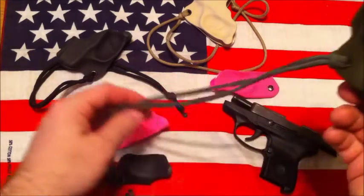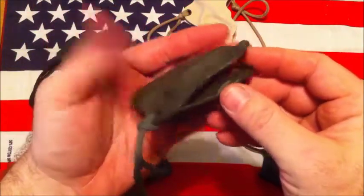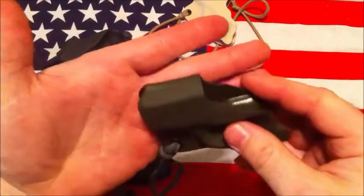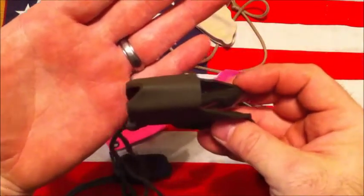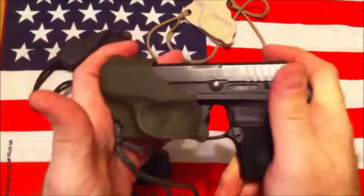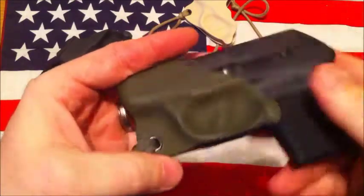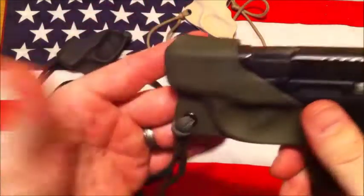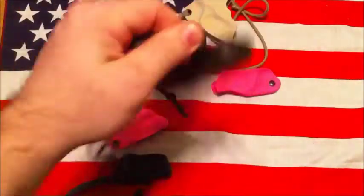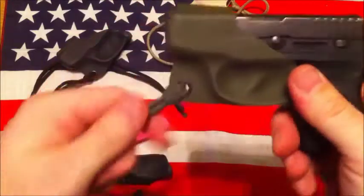This other design actually bends from the top, and I'm a lot happier with this design. You can get some really good flex from the kydex, you don't have to worry about anything — there's not a lot of stress on that radius. You get really good positive lock on the weapon, really good definition in there, and you're not going to have to worry about the kydex damaging. These hold really well and do an awesome job at retaining the weapon.